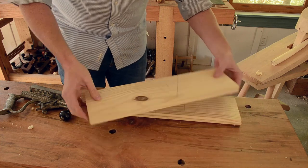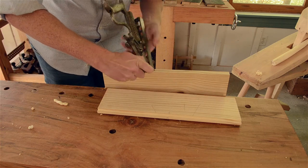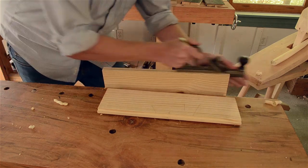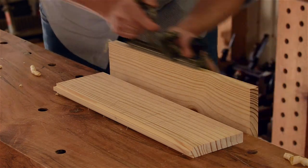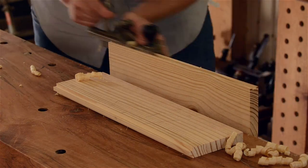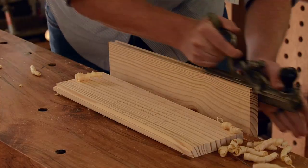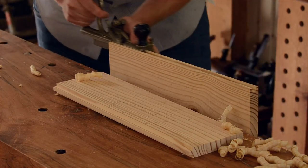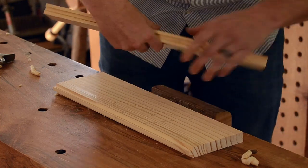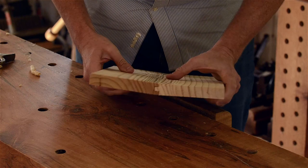Now for the groove board. When lifting it up, make sure the mark is facing you, but flip it upside down. Plane the groove until the plane stops cutting. A finer, less aggressive cut requires more pushes of the plane, but the exercise isn't bad — you can even skip your goat yoga for the day. Notice the joint doesn't fit perfectly tight, but as I mentioned earlier, that's alright, because tongue and groove boards are typically nailed.